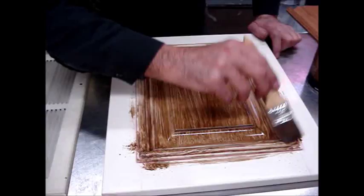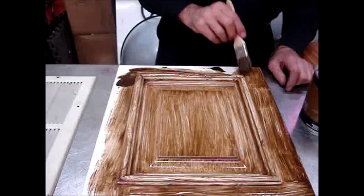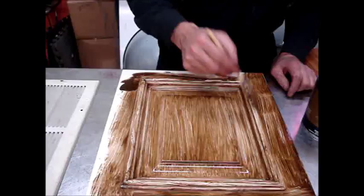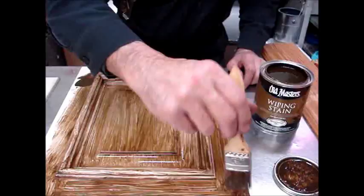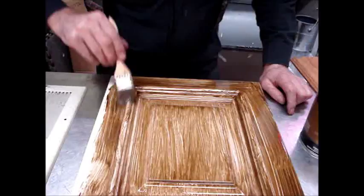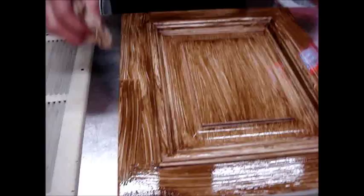As you can see, I've got a lot of time to play with this — this stuff just doesn't dry that fast. If I think I get a spot too light, I dab a little more stain on, then pull it and make it a little darker. If you get too much bleed-through, you can do two coats: one light coat first, come back an hour or two later, and put a second coat on. The second coat will fill in the light spots, and sometimes two coats make a very rich job.